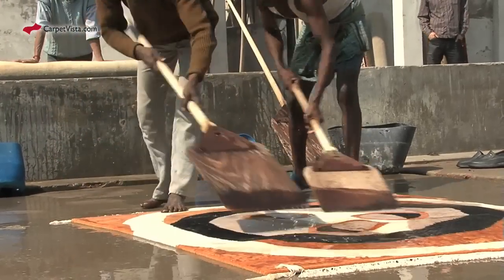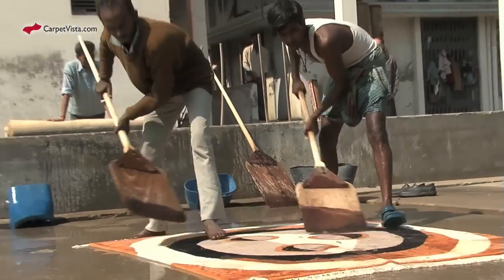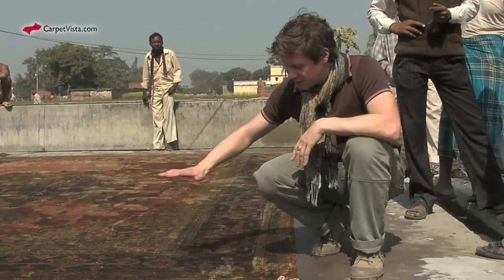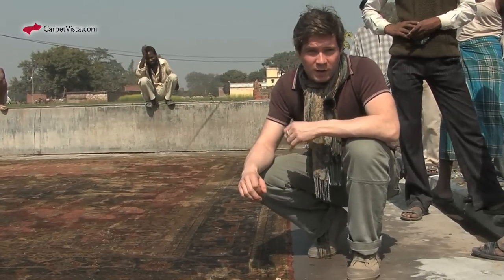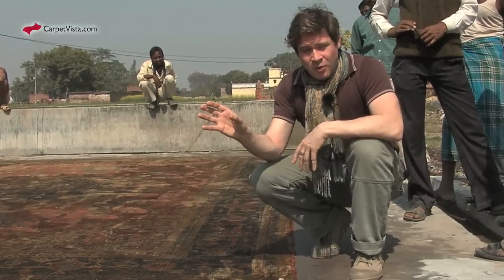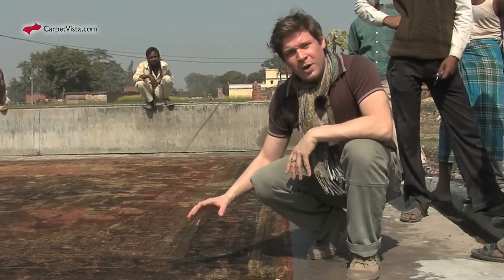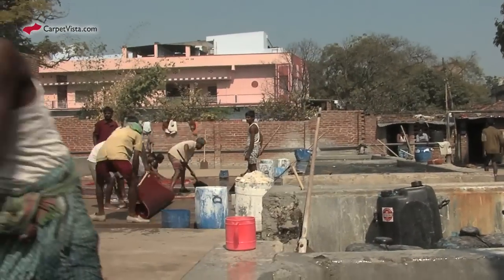For the carpets with antique designs, however, the process continues after the initial washing. Afterwards, a solution of mixed herbs that comes from the mountains and forests is spread around the surface and the carpet is rolled up. It is left like this overnight. This is so that the herbs can enhance the color. Then the carpet is rolled out again the following day.